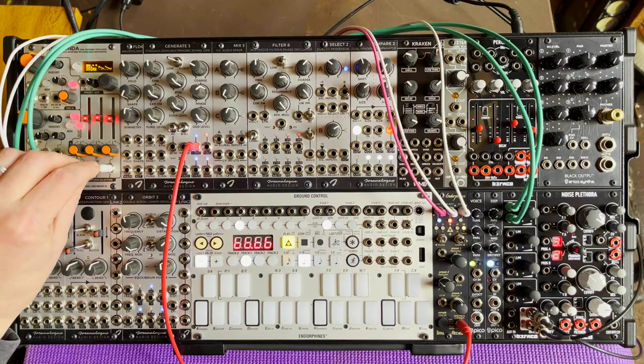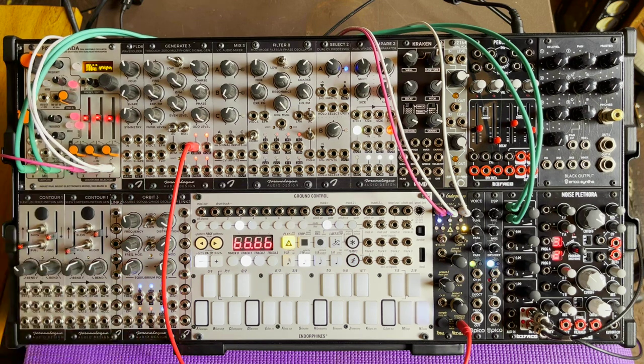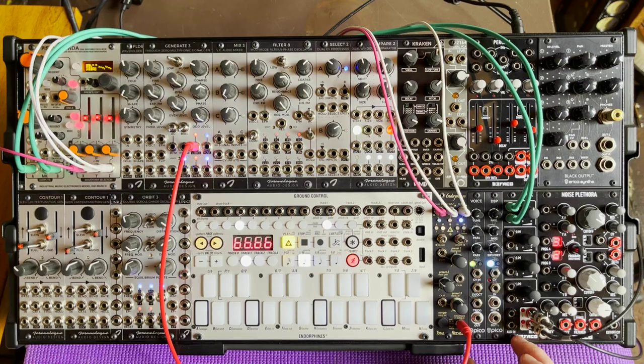You may think, oh, but these are only 3 CVs, that's very limiting. Yes, it can be limiting. In this case, it's not, because you really only have 3 inputs for waveform selection on Piston Honda anyway, so it's perfect. But you can always have more total recall modules, add a couple more, and then you have 9 channels, and you can just split the CV to all 3 modules, and that'll give you external control with the same source of 9 parameters rather than just 3 parameters.